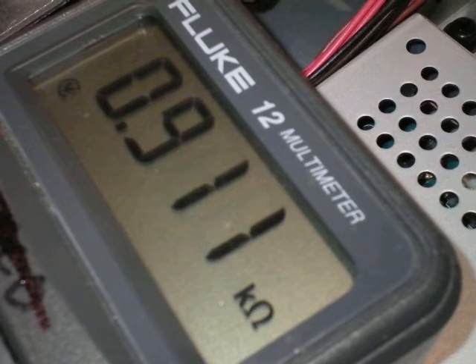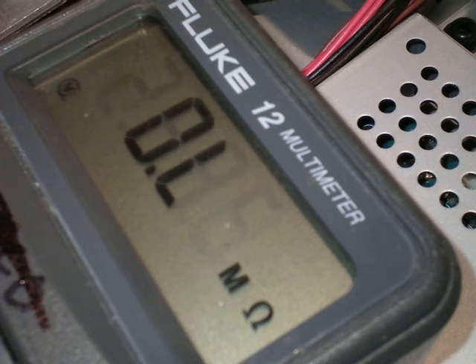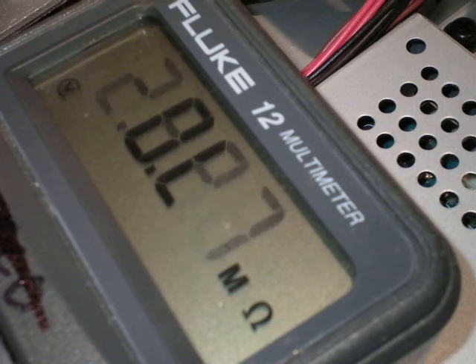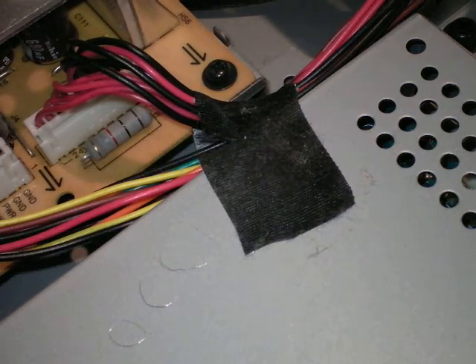You might want to change that out — it might fail later on. Anyway, I just want to show you guys — that's how you read the resistor. You can look up the chart at tampatechblogspot.com. There's a chart there, and you can zoom in using the Control key and scrolling up on the mouse to see the colors better. That's how you read it — thanks for watching, post a comment and subscribe.